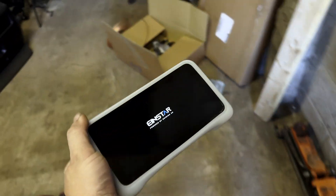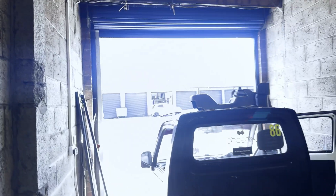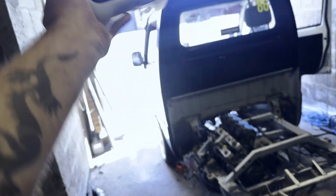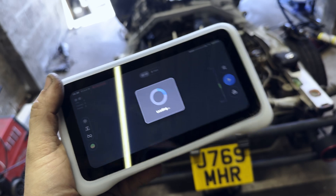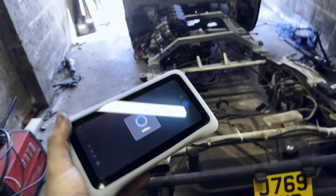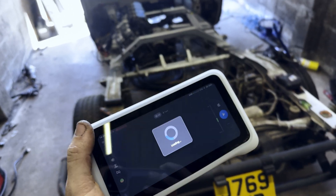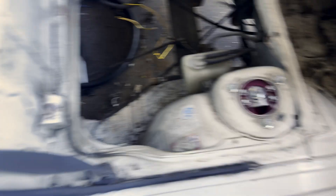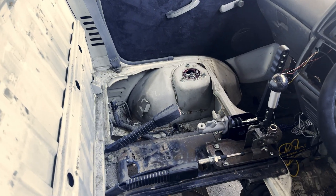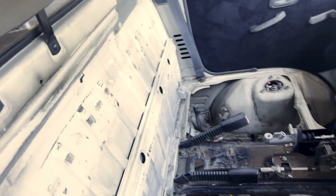Here's the Vega — a portable scanner from Einstar. It doesn't replace the EinScan but adds features like remote scanning: the computer unit stays over there while I scan in here, then take it back to process. You've also got cloud sharing and near/far range scanning modes, tracking dots, and scanning spray for shiny or black surfaces. I'm going to use far mode since I don't need huge accuracy — I just need the seat frames and the back — and I'll set some tracking dots on the flat areas to avoid losing tracking when I stitch the two scans together.